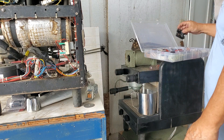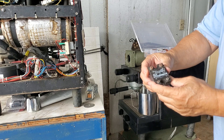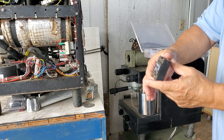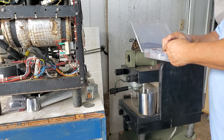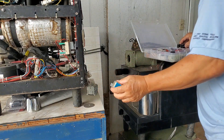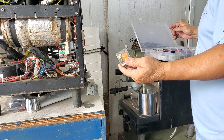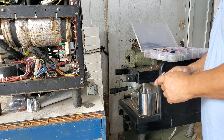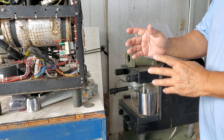On more current machines there's usually a digital power block — in other words, a solid state power switch — and they're usually controlled by simple relays or sensors on a computer board, which turns the power on and off to the heater.